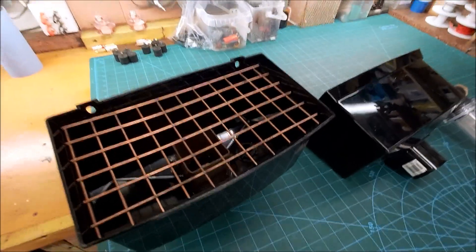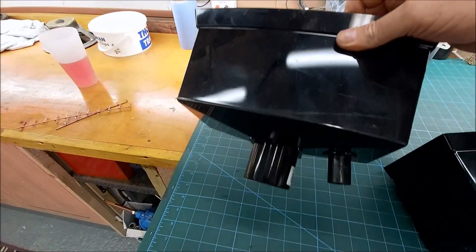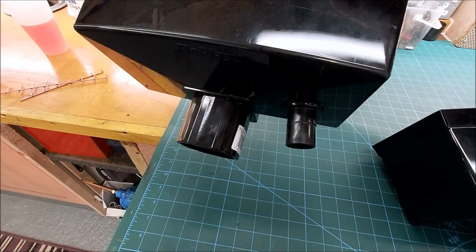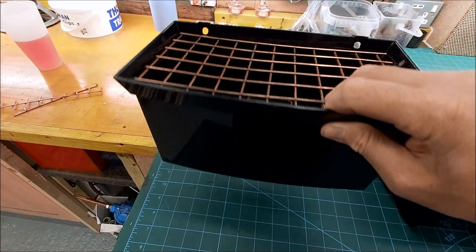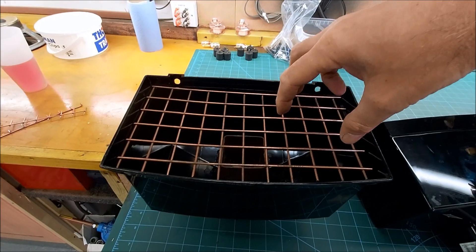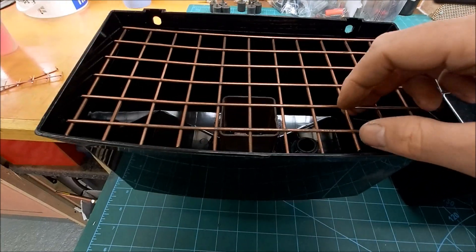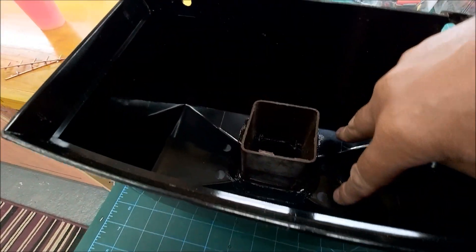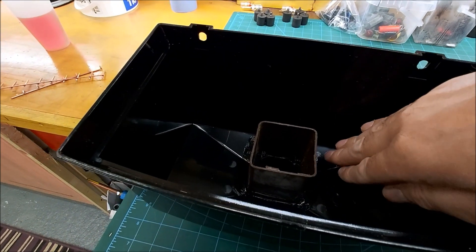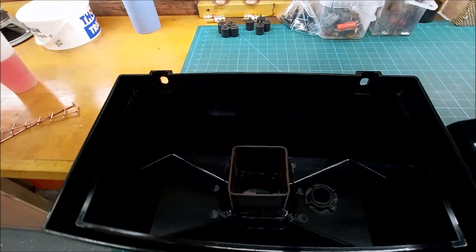These are a couple of the hoppers I'm making for my rainwater harvesting. This particular one has an outlet at the bottom that will go to the rainwater butt via one of these filters. The downpipe will come in off-center, probably with a spout to direct the water. The idea is it will fill up to a certain level and drain through, but if the rainwater is coming down too hard it'll fill up quicker and just overflow straight down the downpipe.